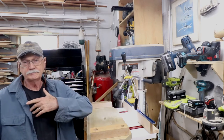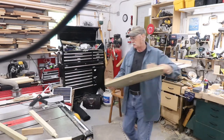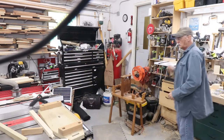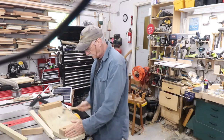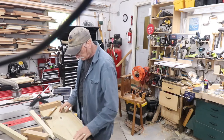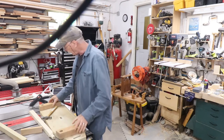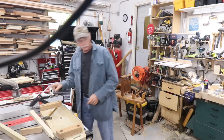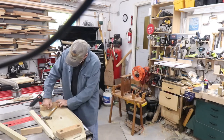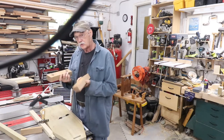Let's move on — knock these off and drill all the counterbores and countersinks in the big holes, then put in the inserts. I'm going to grab a little Warrington hammer. This one is kind of obvious where it goes — it's marked 'top.' I want to put some marks on here so I remember exactly what the orientation is. So there they are — the holes are drilled in both blocks.